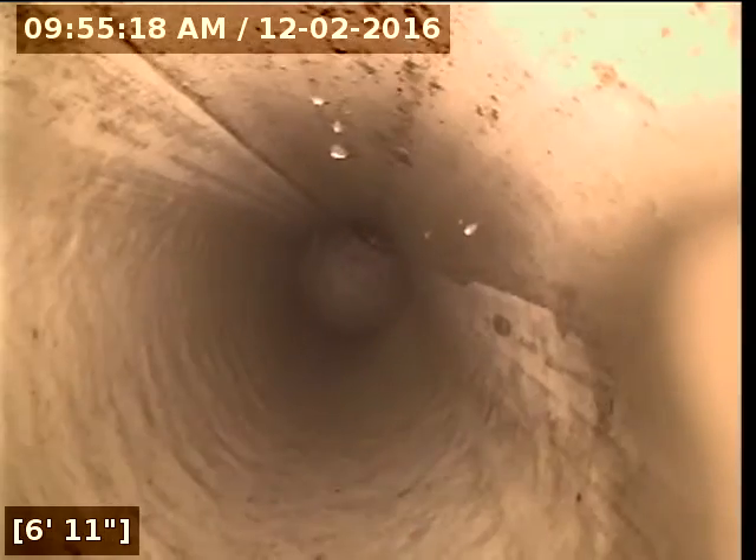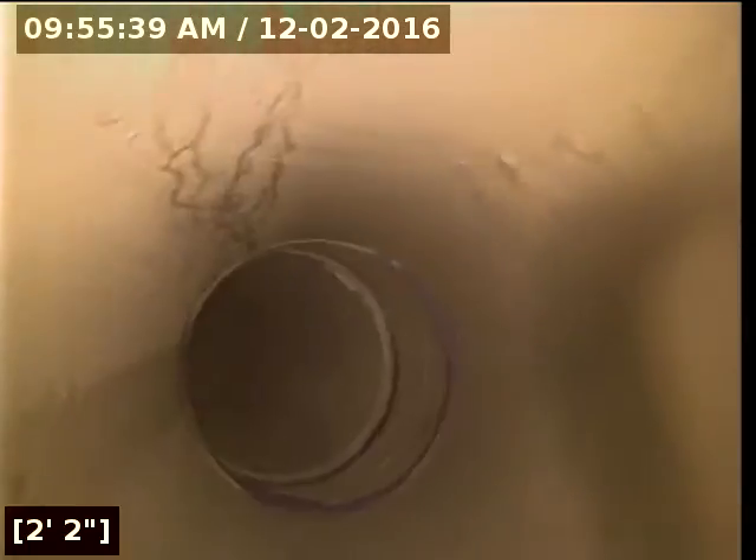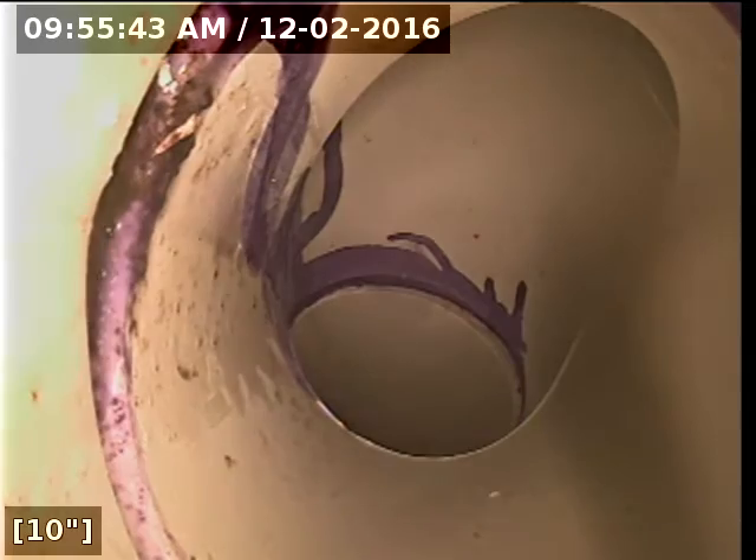This is where the new pipe is tied in here — just a small amount of construction to bring in the pipe. Pulling in the pipe now; this is existing. There is a small clean out. Again, this is the tub drain which we just ran. This is where the vanities tie in. And then back out of the closet flange.